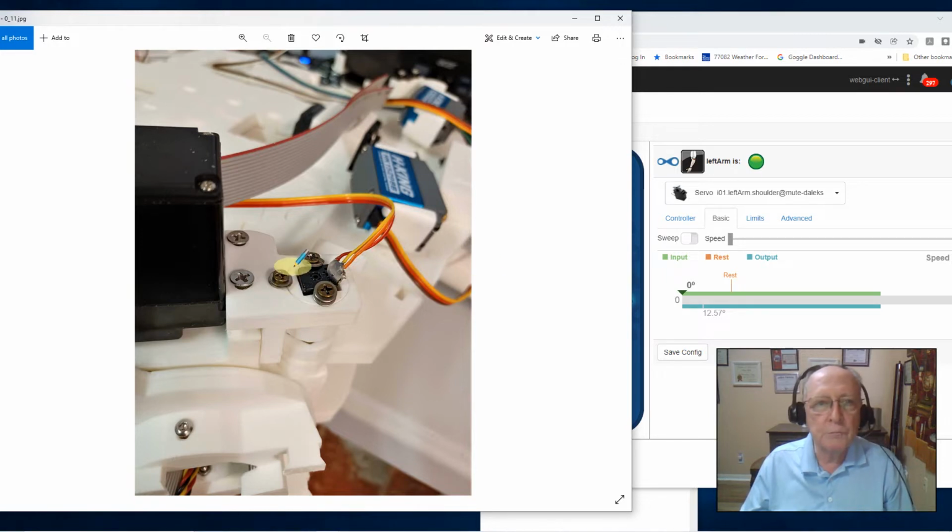So you can see the assembly here. The Omniplate assembly here was on the right hand side, didn't fit well. You can see I had to elongate the holes on this plate to get the horizontal gap in the center of the piston assembly. I mean, of the potentiometer assembly. It was just off to one side, so I had to elongate it so that I could move it over and get it centered. And down here you can see I even had to file a little bit off right down here so that I didn't have any interference with the travel of the plate.